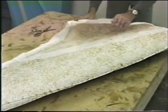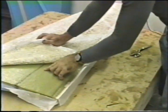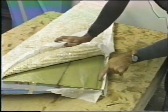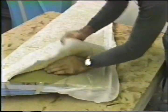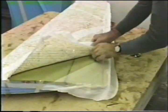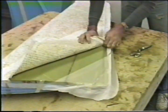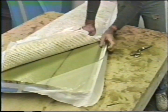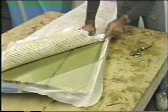If the release film has worked as it's supposed to, what you'll see is the individual small holes, clear perforated plastic over the glass-to-glass trailing edge. The background is the peel ply underneath it. This occurs wherever the bleeder didn't lap a laminate. I'm sorry, not the bleeder, but the perforated mylar. It doesn't hurt to make the mylar, or Tedlar in this case, an inch or so wider than the part around its entire perimeter so that you don't get this kind of perimeter bonding.